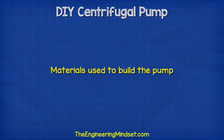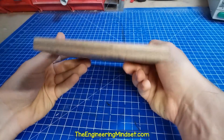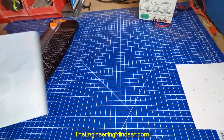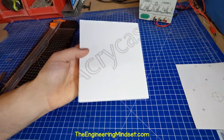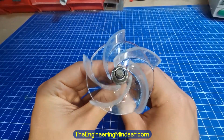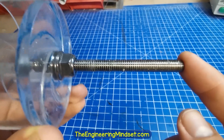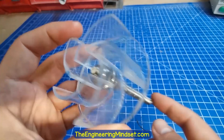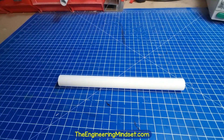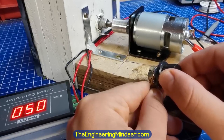To keep the design simple I used materials that were readily available and easy to work with. For the pump casing I used marine wood — a strong material formed with waterproof glue, often used to build boats. I used a thick sheet of acrylic on the front with a rubber seal. For the impeller I also used acrylic because it can be fused with solvent to form a very strong joint. The shaft was made from stainless steel threaded rod and locking nuts to resist rusting. The pipes were made from PVC because it's cheap and has a very low friction factor. The pump is driven by a 775 DC motor with a variable speed drive.